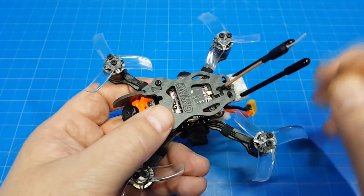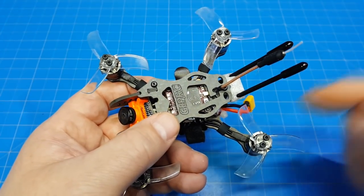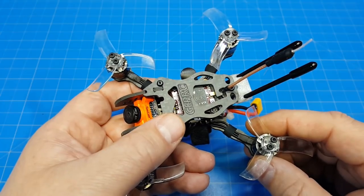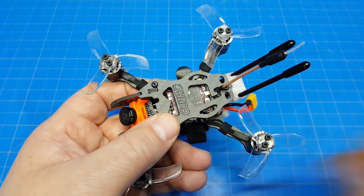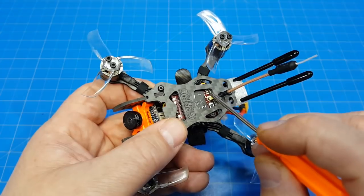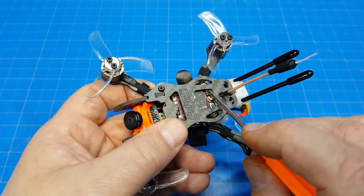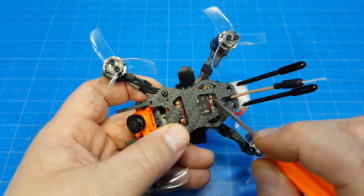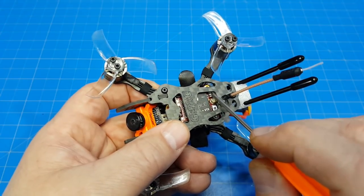I do think that I ran mine on 25 milliwatts, so the breakup that you saw, you might not have if you pump it up to the highest power level, which is 200 milliwatts. You have little LEDs up here that indicate these things. I think it goes blue, green, and then red, where red indicates your power. That's the bottom LED, and the other two indicate your channel and your frequency.